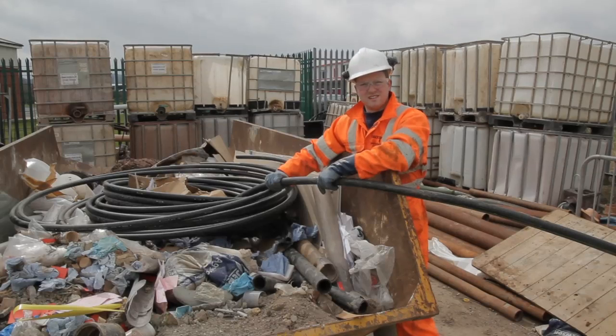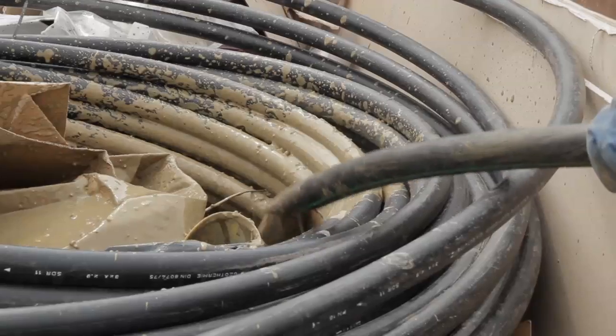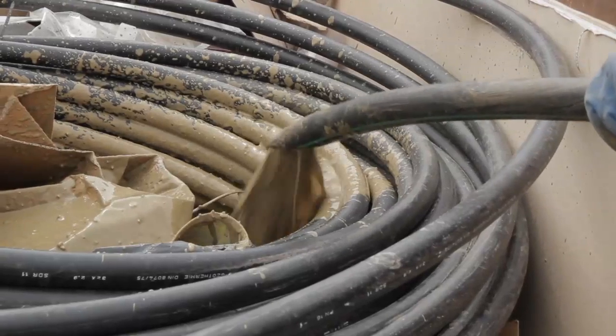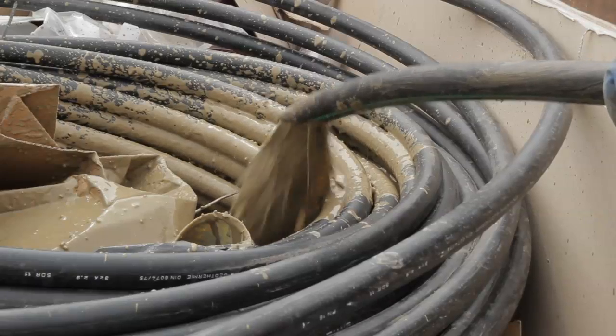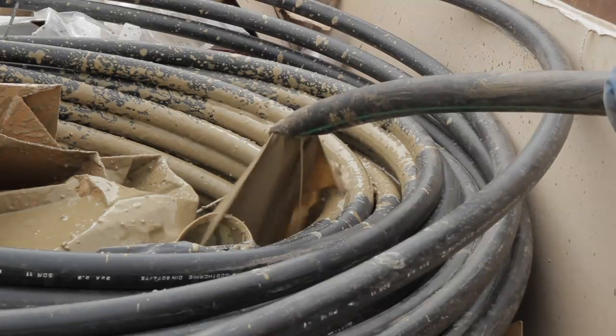You're highly likely to have excess grout in the mixer and the tremie, and it will need to be pumped out and the system washed. But do not pump it onto the ground — instead, pump it into a skip or waste container and avoid contaminating the surrounding area.